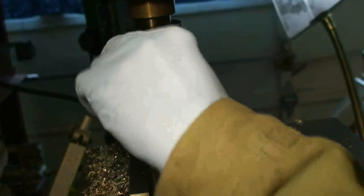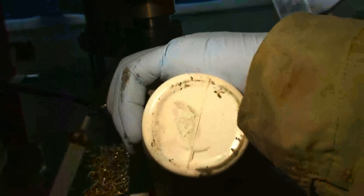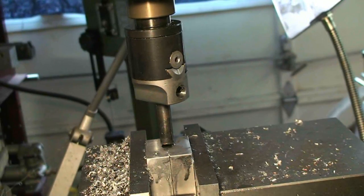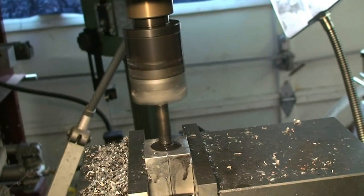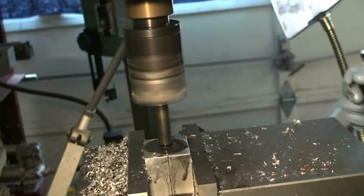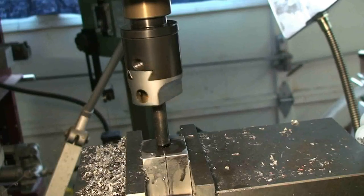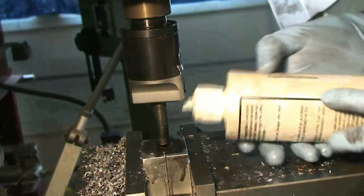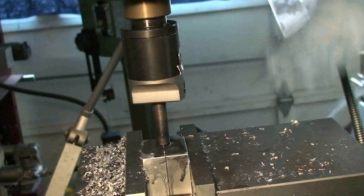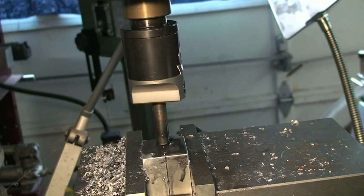Make sure we got it out all the way. Now we fill the hole with cutting fluid again and turn it on — now we keep cutting. I have found that if you fill this cavity up completely with cutting fluid, it helps all your waste metal come out, because you're not going to keep pulling the bit out like you would drilling a hole, and it doesn't have flutes to guide the metal out. The cutting fluid helps the chips float out, so just keep the hole full of cutting fluid.